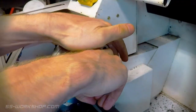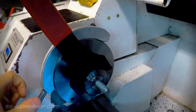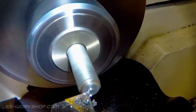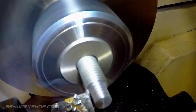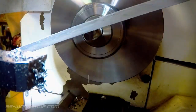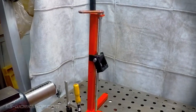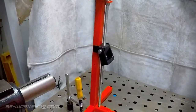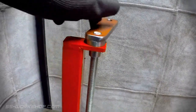With the bushing done, the next part on the list is the threaded rod. I'm using M10 threaded rod, which I load in the collet chuck and turn an end feature that'll fit into a hole in the frame. At this point I assemble the parts that have been completed — you can see the threaded rod in place along with the painted parts completed in the last episode. The crank arm is fitted but needs a handle, so that's the next part.